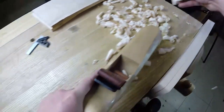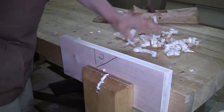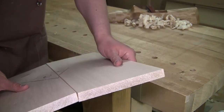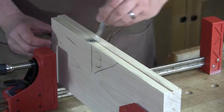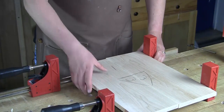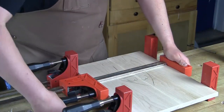If you look at the edge of the board you can see I am planing off-square. When I clamped these so that one board was higher than the other, this intentionally slants the plane and you create a strongly beveled edge. This results in a glue line that's easier to get tight and seamless — just like double-bevel marquetry technique. You can see the off-90-degree angle and how it comes together for a flat panel. A little glue on both edges and into the clamps it goes. The beveled edge tucks up under the other one, and with enough pressure one board will ride up over the other, so I drop a clamp on top to hold it in place.